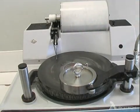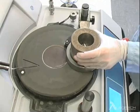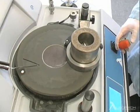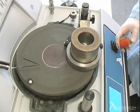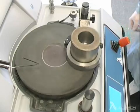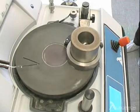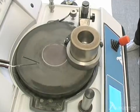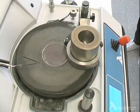The first step in using the PM5 system is to ensure the processing plate is the correct shape prior to lapping. This is done by placing a weight on top of a grooved test block and running it for a short duration prior to processing. This allows for materials being processed to be shaped convex, concave or flat depending on the customer requirements.